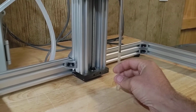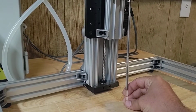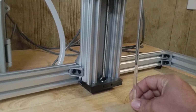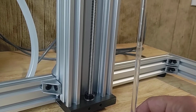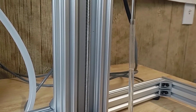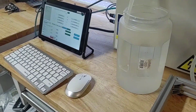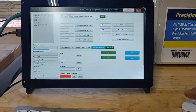And what you're going to see is the nozzle is going to go down. It's going to do a quick little reverse fill, which kind of would fill up the bottom with a little bit of fluid so there's not any air pockets. But you're going to see the nozzle is starting to raise higher than the fluid, which will cause an air pocket, so we know that we aren't filling fast enough at all. You could just see we're going to have a big gap there. So that was too shy. Just try to get all the water out of the stick. Okay. Set that there. Okay, so that was too shy.